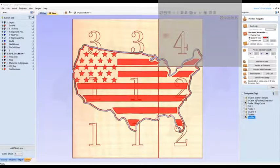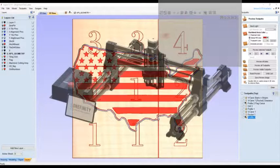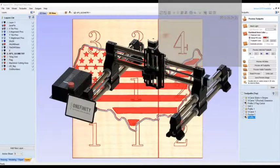And problem number two, I didn't talk about it yet. I will in my next video. There's an issue where you cannot shift the board on the X beyond the 16, or I think it's 20 inches of clearance between the rails of the machine, because they get in the way. Now, I've thought of a way of getting around that, due to the nice features in the design of the machine. But that's a consideration. And if you want to enclose the whole thing, having this 16-inch shift to the left and to the bottom eats up a lot of space.